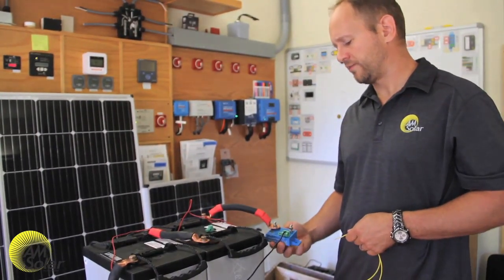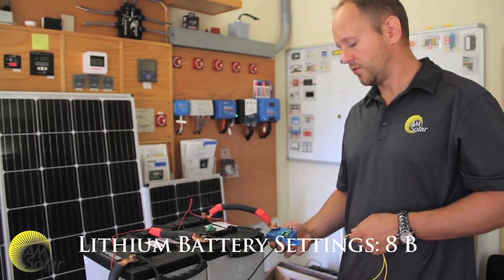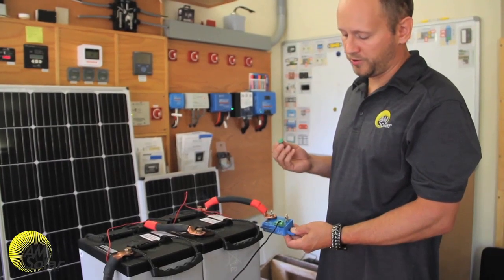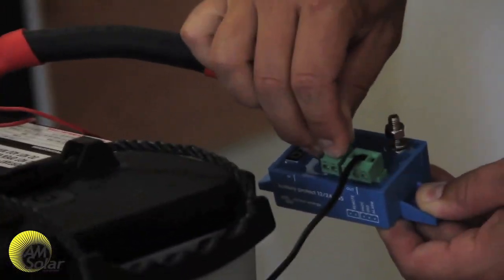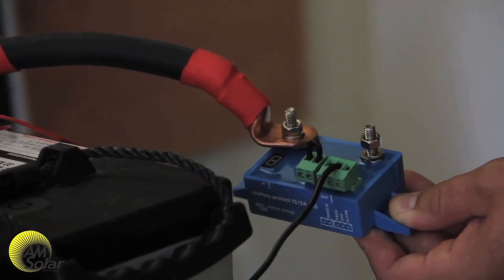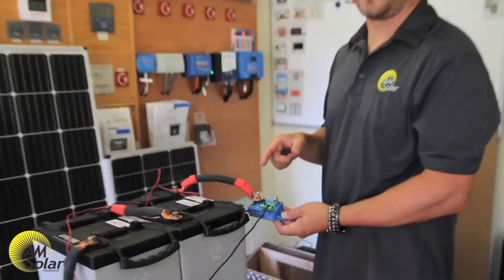If you have one of these on our LifeBlue drop-in lithium battery banks, it's kind of redundant because the LifeBlue batteries automatically disconnect when they get too low. But as a backup feature you would put it on 8B. After you've programmed your battery protect, you put the jumper back in. In our kits, we take this black jumper wire out and run it to a remote switch. When that switch is open, all the loads are disconnected; when it's closed, your loads start up again — so it's like an on/off switch for all your DC loads.